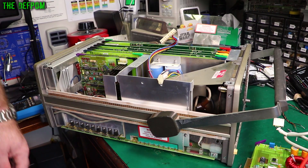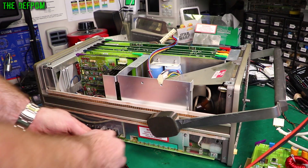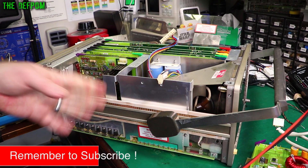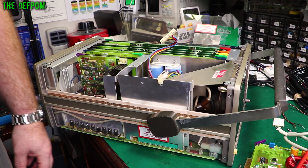Let's go back to Diode Test and just recheck that again. We're chasing something which isn't there, that's annoying. Through is 0.581, that's fine. And this way is 0.90. So probably circuitry is powering which is causing a problem. I think we can just ignore that now. Move on.